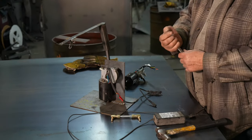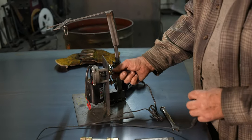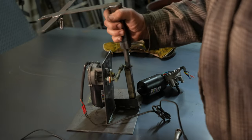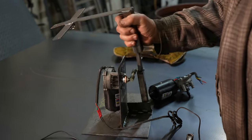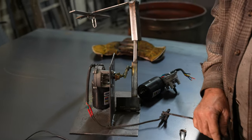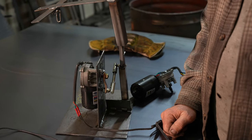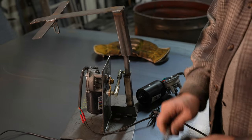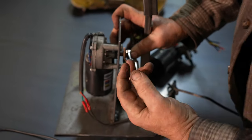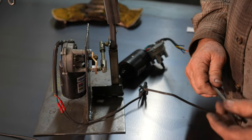One other issue: once in a while this little nut on the linkage will loosen up, but you don't catch that it's loose. It quit moving — and it's because that little nut loosened up a little bit. You just need to re-tighten it. On a lot of the product we put out, I'll go ahead and spot weld that nut so it doesn't loosen up.